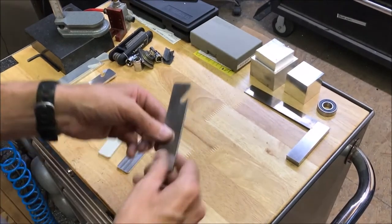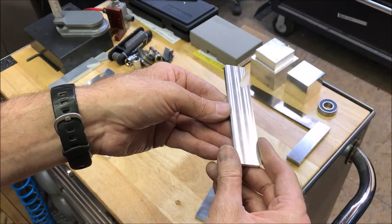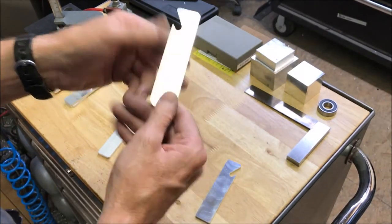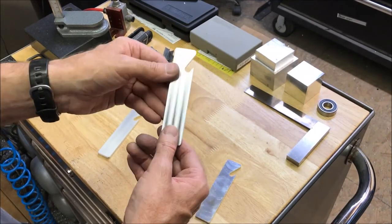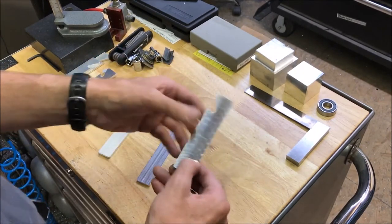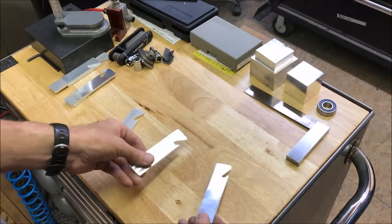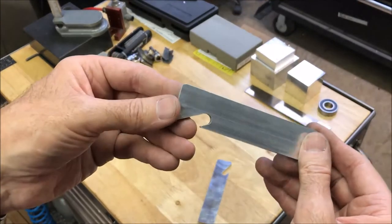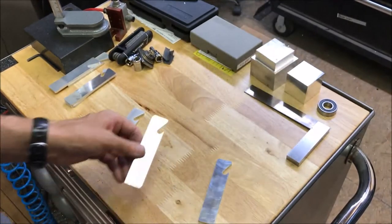Certainly a lot faster, but I could have gone faster on this other one here, the one I did at 2500 RPM with 3/8 end mill, but you know, I wasn't sure whether the work holding was going to be good enough. I could see that the way I ran this, I should be able to run this faster. I kind of like this pattern better. I guess if I was going to do this unfinished, maybe I would do it this way with the 3/8 end mill.